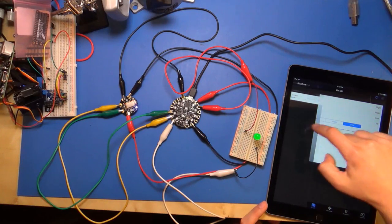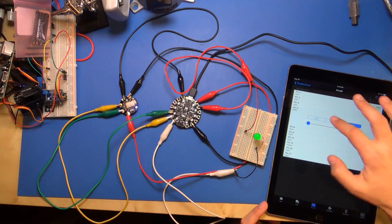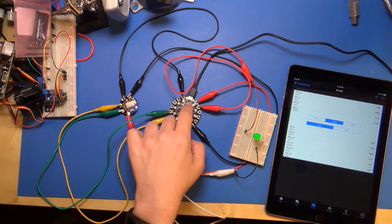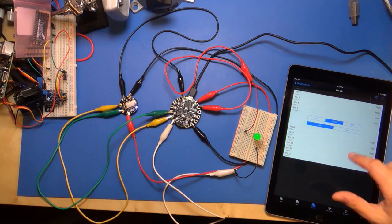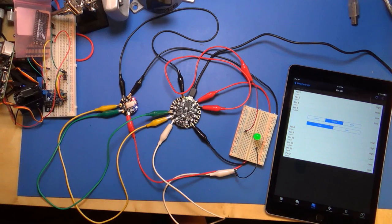And that's just because the way that this PWM works isn't really the way that you control that audio. So I'm just going to turn that off, but there is some stuff you can do. Unfortunately, the analog components, the light sensor, temp sensor, and the microphone, for some reason I can't read them with the pin IO right now. I think it's a little weird thing with the firmware. You have to basically tell it exactly all the pins that are configured. And so hopefully we'll be able to fix that later.